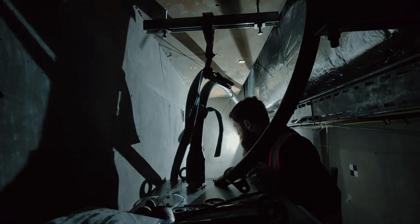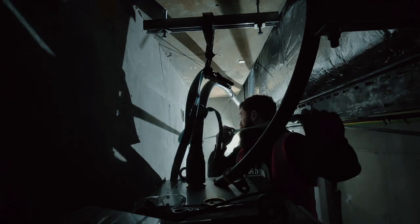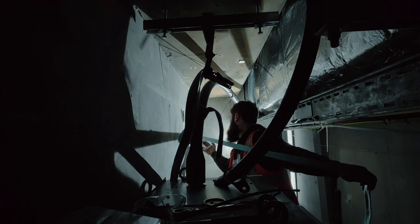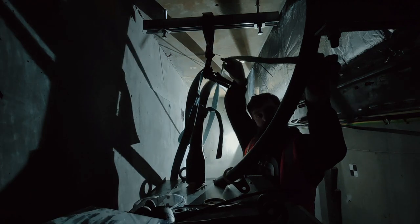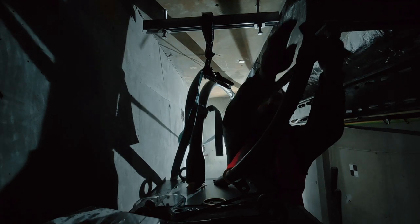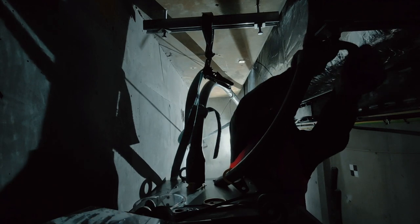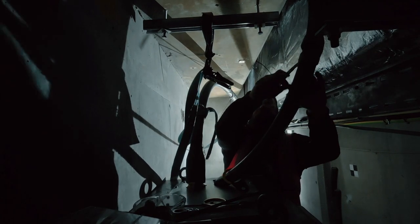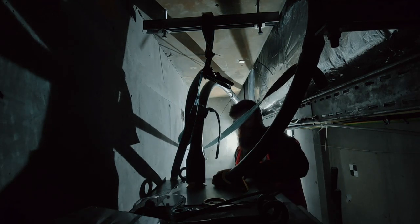Right, I'm going to do the same. I'm going to tie this on. What this does, it pulls against the hole. It sort of straightens the cable up, rather than me wrestling with it. It's easier to do it that way. Just place it on the back of the bend, not too low down. And also what it does is, as it's straightened, it lifts that part of the cable up over, so it sort of forms the bend again.